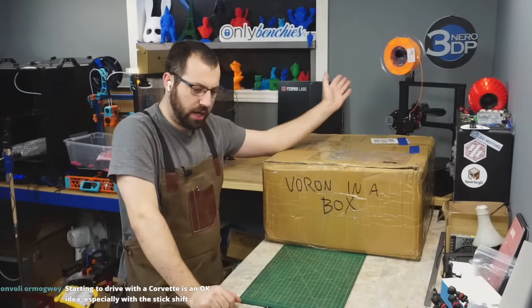Yeah, I guarantee you it's an 8 mil plate that they ground or machined. I'd rather see blanching marks. So if you look at your plate and you see swirls, like a semicircle pattern on it, that means it's blanchard ground. Usually how they make that, they make the 4x8 sheet of it, and then they blanchard grind the whole thing, or whatever the proper term is. And then they go ahead and cut it into the sheets. So the bed is okay. For an AliExpress bed, the bed's fine, as long as it doesn't taco on you, which unfortunately I can't check.